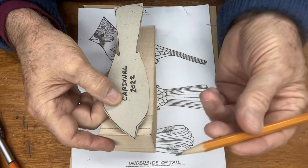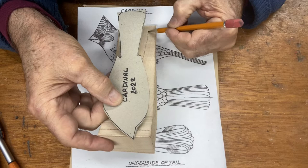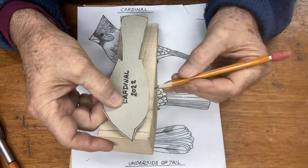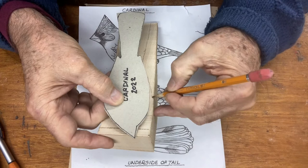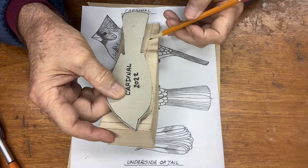I'm getting a pencil, and I'm looking down from the top. I use a pencil because if I use a ballpoint pen I may want to change this - you think you have the top view drawn on there and it may not be exactly right. I also want to make sure the whole piece is on top of the wood. I'm drawing this along the edge of the template as I'm looking down, and I'm going to do it on the other side as well.